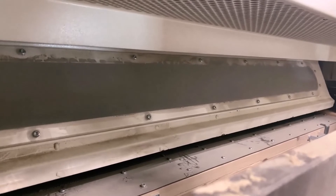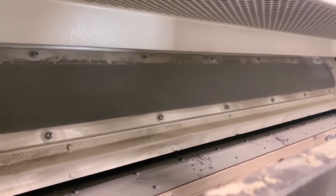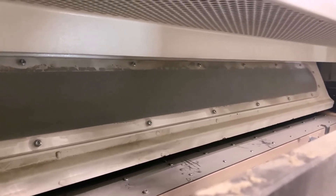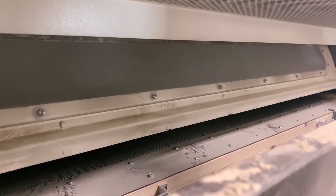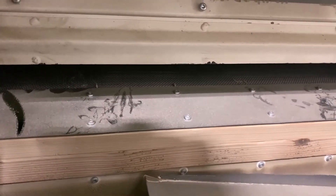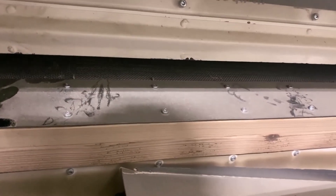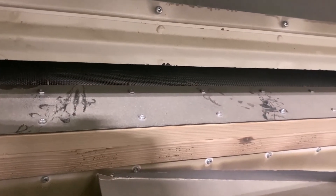So I talked about the control box — now it controls this air lifting hood, which is number four up top. This allows us to have even more flexibility in setting. I'm going to lift this up. There's actually a screen inside — all the seed comes off the last three decks, hits this screen, and this screen is shaking with the machine. We have air on the bottom blowing up through this screen.